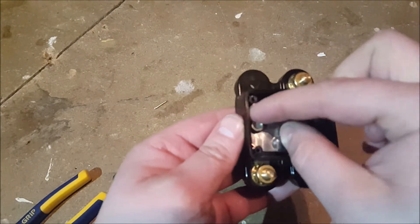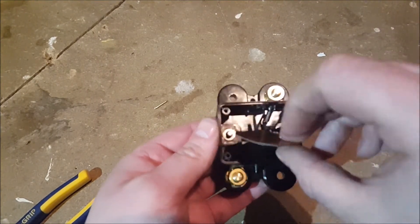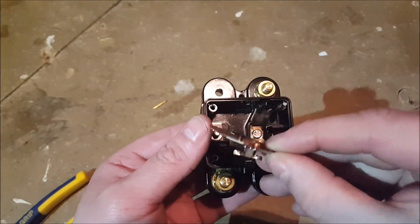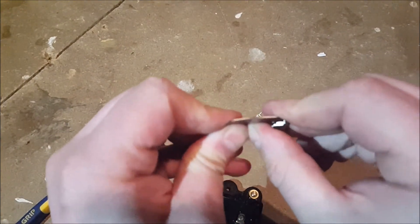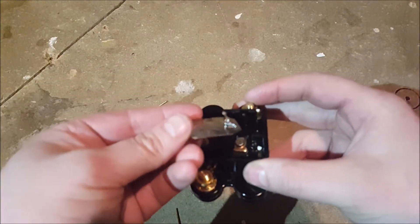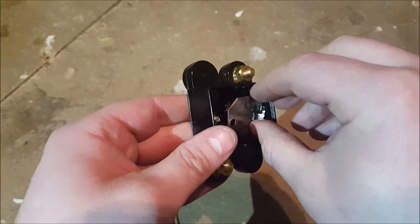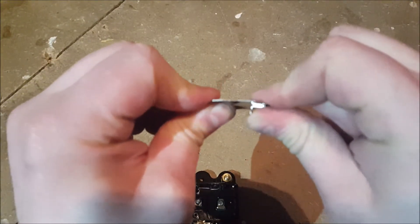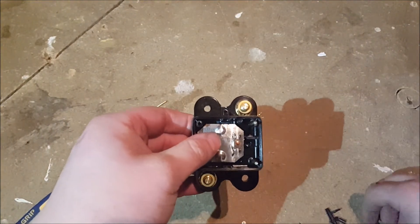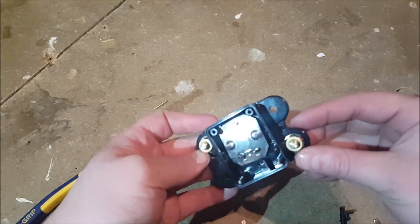Let's have a look at the bimetallic strip — get this bolt off. This is made up often of copper and steel. Here's the plate, and what happens is as current flows through, it joins the contact there. If it breaches over 300 amps, the copper will expand faster than the steel, forcing the strip to bend upwards — very simple. Moving parts, and that's what's failed on this. What do you expect for something that's traveled halfway across the world? Didn't last very long, but it was interesting to open up.